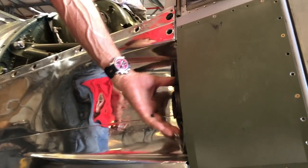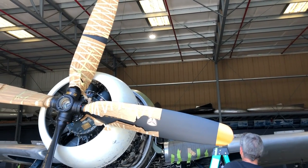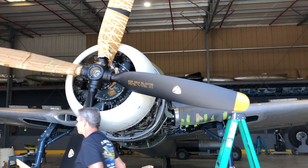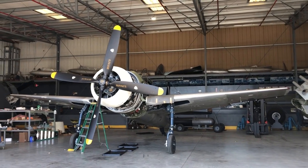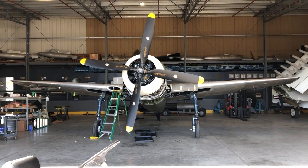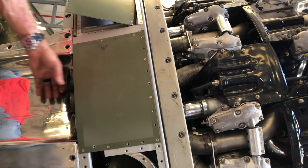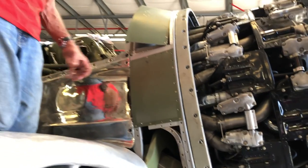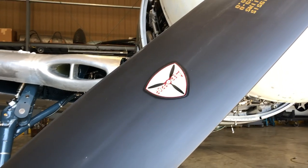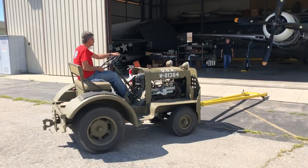All 18 cylinders are funneled into six exhaust pipes. The thrust from the exhaust gases actually produces thrust — it works out to about 10 pounds of thrust per 100 horsepower, so at 2,000 horsepower that's a couple hundred pounds of thrust. This came out late in the war — called jet exhaust stacks. When we had our Super Corsair, we had two-and-a-half-inch exhaust ports. One of our engineers did calculations and we made clamp-on reducers down to two-and-a-quarter inch. We flew it both ways on the race course and the reducers gained about three miles per hour.